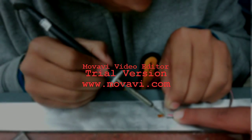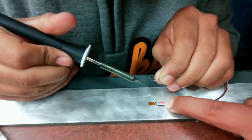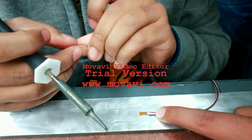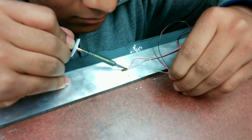Soldering — the most important part. Clean the soldering tip using tissue and apply some solder to the terminals of the strain gauge. Align electric wires to the gauge terminals using tape, then carefully solder the electric wires. Do not overdo it.